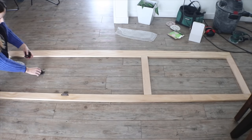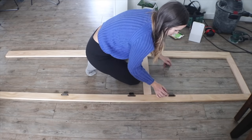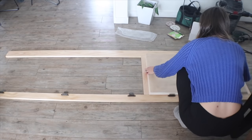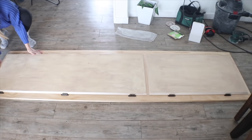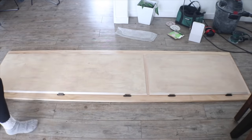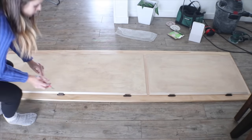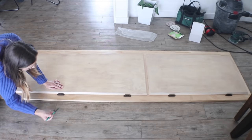Now I have all my pieces ready to assemble. I'm going to get everything lined up and pre-drilled on the horizontal surface of the floor — this is going to make things so much easier versus installing the face frame and then trying to get the doors lined up vertically. I lined up the hinges where I wanted them, measured things out, laid the doors where I thought they looked good, got everything squared up, then marked the holes to pre-drill for the hinges. I marked the tops and bottoms of the hinges so that when I flip the door over I can know exactly where to pre-drill and attach the hinge on the back of the door.